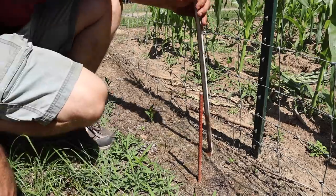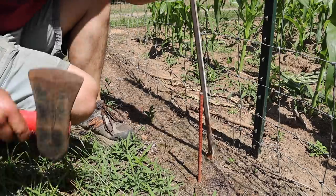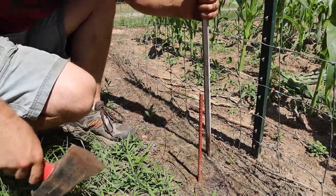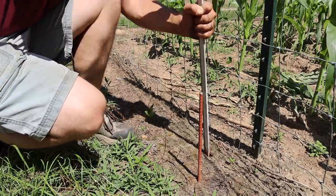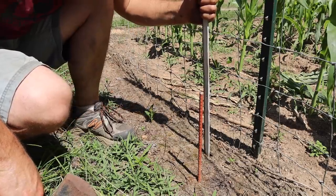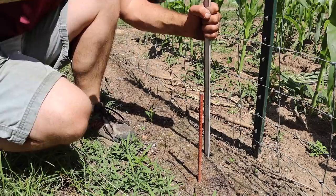The instructions actually say to put three, of course, proper ground rods out. I'm going to put three of these out. The third thing that I have is actually a galvanized pipe, but I think with the moisture content here, because the garden gets watered constantly, and the fact that there are three of these, I really think that would be more than sufficient.